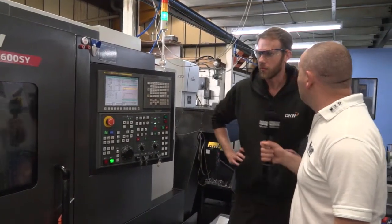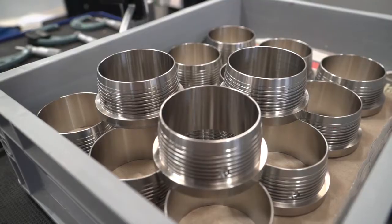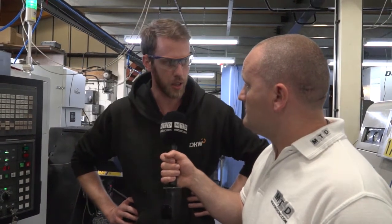So what other features do you like on the machine? How does the Y-axis hold up? Yeah, the Y-axis is pretty good. We do a few jobs on here now where we've got to do a bit of helical milling to rough out some bores, just to try and get rid of the swarf. We do have certain materials where it's a little bit difficult to get rid of the swarf using conventional boring. So helical milling with the Y-axis allows us to get rid of the swarf in a more manageable way, to finish the product off to customer requirements.